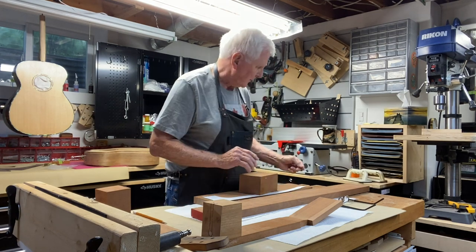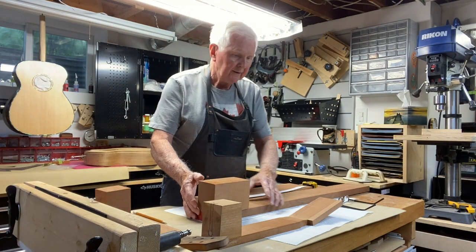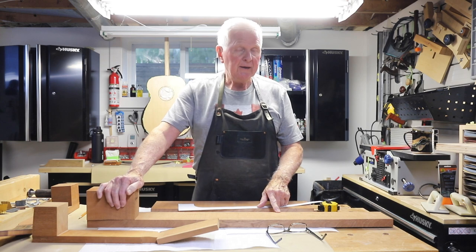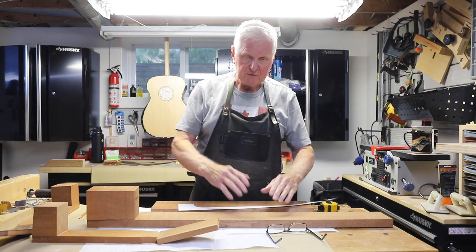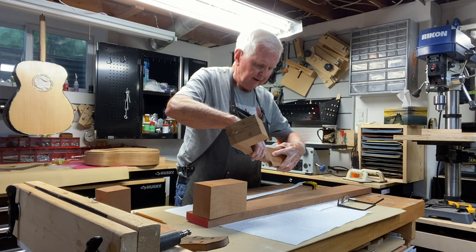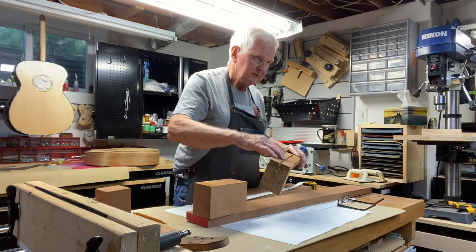It's over length — quite long actually, you don't need it this long, but it's six inches. What we'll end up doing is gluing that on there like that, so after we've cut a scarf joint here. A scarf joint is one that's at 13 degrees — it comes down, then you flip it over and glue it together so that it comes over and down. Right in here is the scarf joint, cut on an angle, and turning that over is what gives us the slope for the neck.